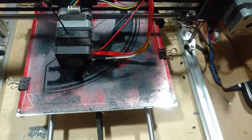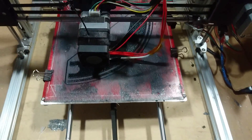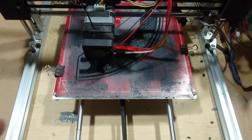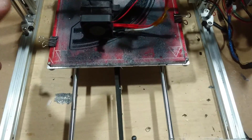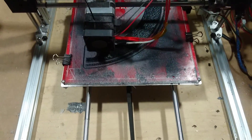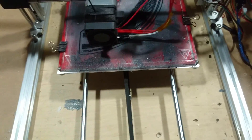So for me with this, what I've done is initially I tried the blue painter's tape and it didn't work too well. I started my first print off with ABS, went across it and started peeling up at the corners. So I decided I'd pause it real quick, put some crazy glue down, hold it down until it's stuck and then continue printing. Well, as I continued to print, the corners started lifting up and peeling the tape off the bed.